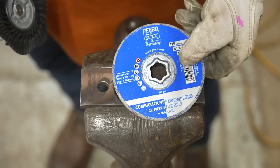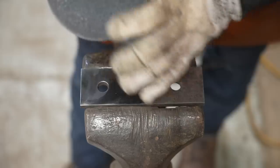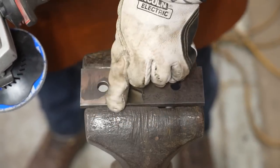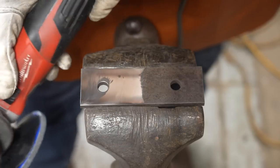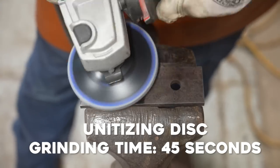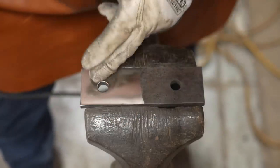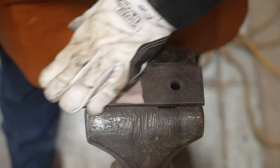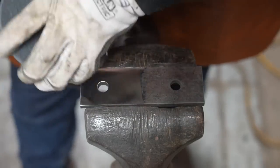The last step on this is a unitizing disc. These are great for getting almost a polished finish — no compound, but it's going to be a really bright and very smooth finish. Great for that kind of cleanup. There's kind of some weird haze in this, but this will take it out. I'm going to bring my grinder speed down pretty much all the way because I don't want to burn this out going too fast. And that is beautiful. You can see there's a little bit of polish to it — you can see the reflection of the backside of my glove. It's not what I would call a mirror polish by any means, but certainly a clean and nice finish from that unitizing disc.